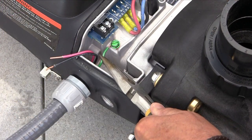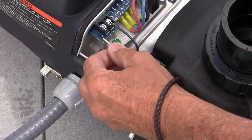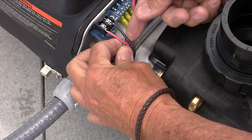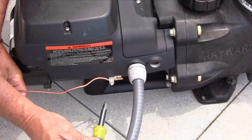As you see in this shot, make sure to wire the ground wire first before connecting the high voltage lines. This will make the installation easier. Fighting to connect the ground wire after connecting the high voltage line could cause a few choice words to be said. Make sure to connect the bond wire as shown.